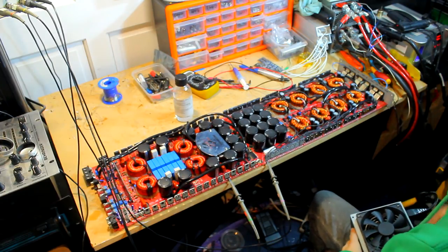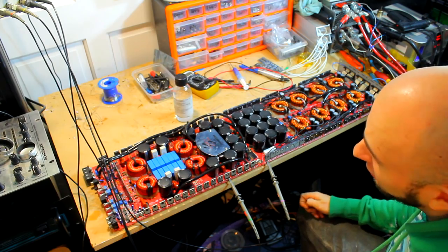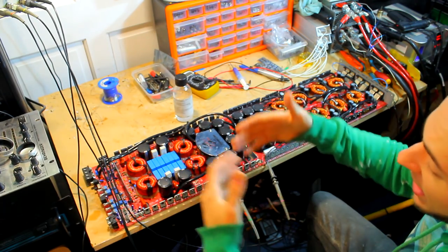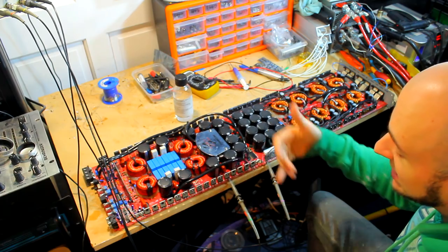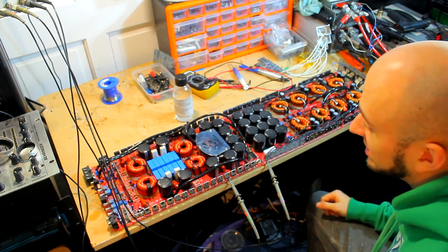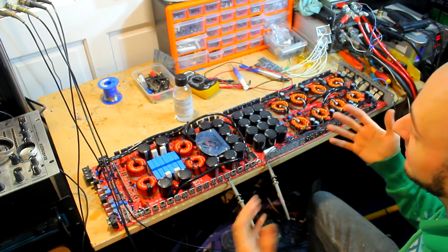That's because at the end of the day, the heat dissipation from these FETs is the only thing that allows this amplifier to do its rated power. These FETs on their own, not mounted to a heatsink, can only do about 3 or 4 watts before they explode. So how do you get these FETs to do near 10k with all of them? They have to dissipate the heat that they generate in order to keep doing more power. If you've got poor contact to the heatsink, and the FET can't get rid of its heat, then it's going to explode and you're going to have a failed amplifier, or one that's not doing rated power. So it's very important to sort out your thermal compounds and thermal transfer to the heatsink, as that is the only thing stopping your amplifier from overheating and potentially failing.